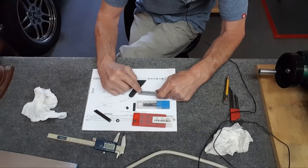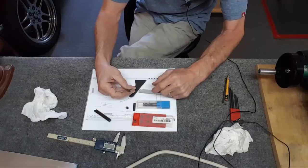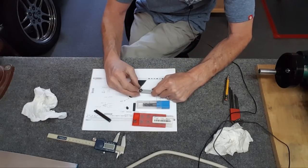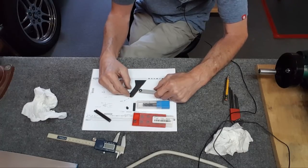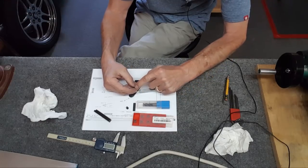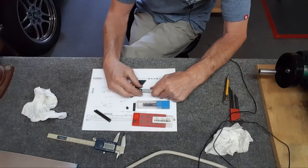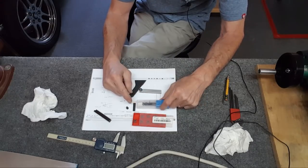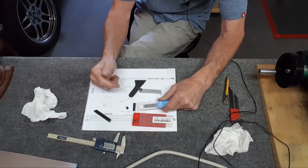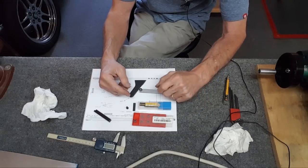Not sure how to clean that up, but this width here is that bottom small dimension, so it sits on there. Now it'll be rotary table time to do the radius of the small, which is 175 thousandths, I'm figuring. And then I've got a 10 millimeter end mill, which is a few thousandths off of that radius. So I'll be able to come in with this guy, another Banggood Drill Pro.